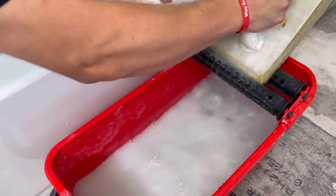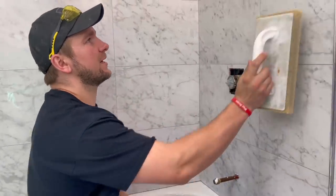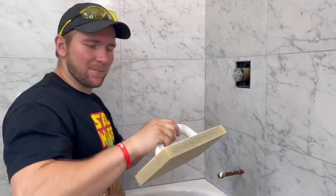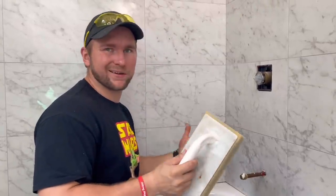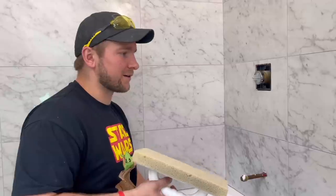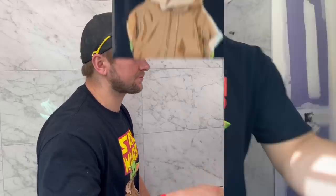I use one of these grout buckets when I'm grouting. It has a nice flat surface so when you're washing it out you're just gliding over the tile, keeping these grout lines super full without washing them out. Also, when using this, my hand stays dry — when doing a big floor and washing for a couple of hours, your hands do get messed up from the grout itself, and wearing gloves is annoying because water gets in them. I'll have a link in the description — it's like 35 bucks, no-brainer. With one bucket of water I was able to wash this entire shower, so it's pretty efficient.